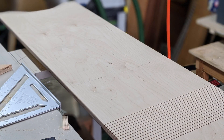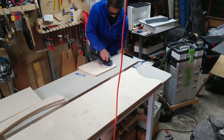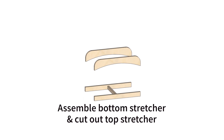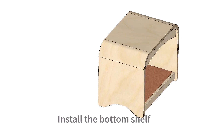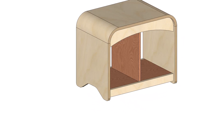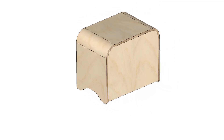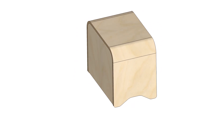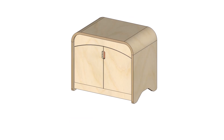Here's some finished shots of how it looks close up. I sanded and pre-finished all the parts as much as possible before the major glue-up. My process for assembly: I started with the stretchers, connected the stretchers to the shell, dropped the shelf pin at the bottom, installed the center divider, then fastened the back panel into the stretchers, and then simply put in the inset doors.